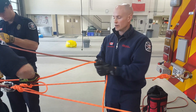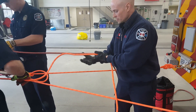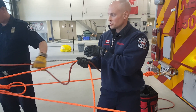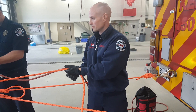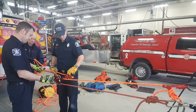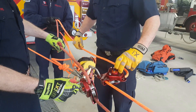The other thing we can add to this, if we have the manpower, is a third person. This person is a rope tailer. It's an old technique, but it's brought back for this type of system. All they're doing is hand over hand, letting the rope go through. The advantage is that if one side were to let go, they can help add that extra friction and catch the load to really minimize the fall distance before the line catches and stops the load. Another advantage with having the two MPDs side by side is that one single person can tail both lines.